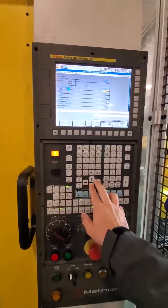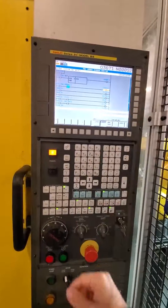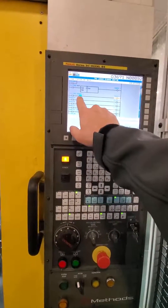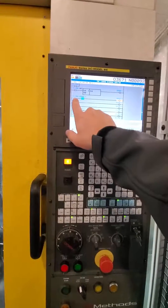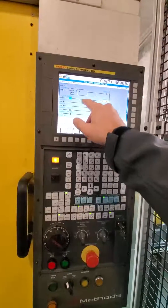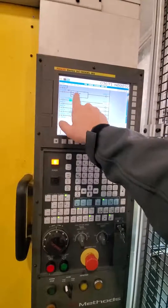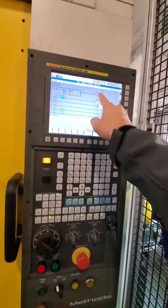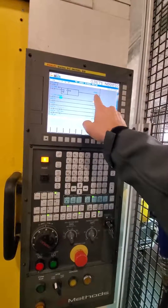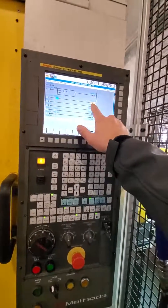The address of the output that runs the motor starter is Y16.5, and you can read that in the back of the mill. It's run by R000 and then Cycle Pro — which I believe is just Cycle, meaning the mill is running in cycle. And then it all runs through this timer. So the idea is that the machine is on, the timer is timing, and while the timer is timing this is off. But when it's done, this turns on, which turns this off, so this line goes cold.